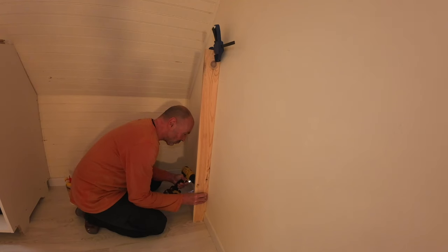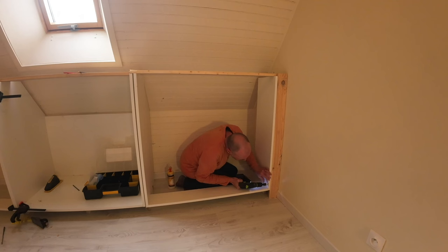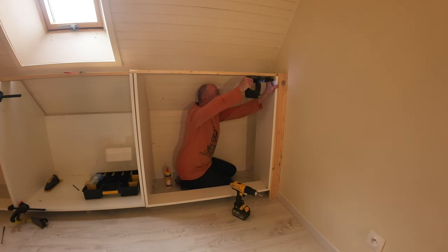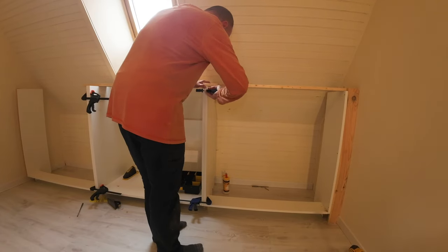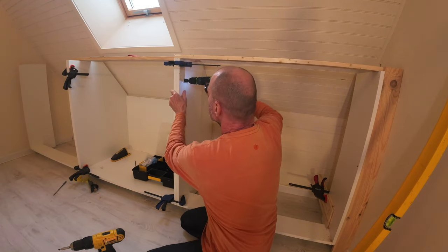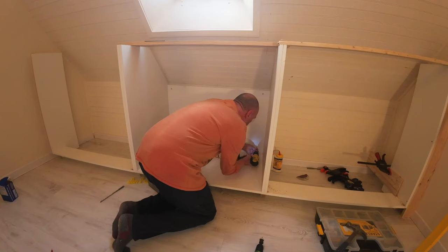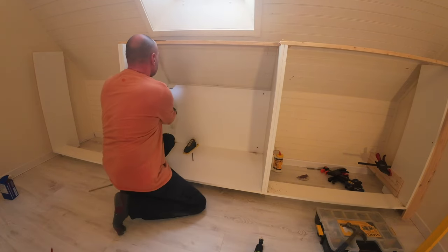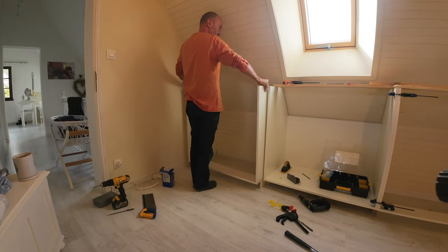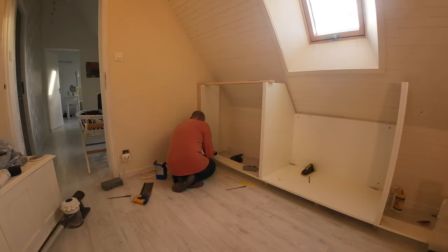Back in the bedroom I needed to fettle the scribe to the wall to ensure the best fit. I could then glue and screw that piece to the ground I had fixed to the wall. Next I insert the right hand wing and fix it to the piece I've just fixed to the wall. Pieces of timber at the top are just temporary braces. With the right hand frame fitted I can now screw this frame to the middle section and screw the middle section back to the wall. Finally the left hand section is secured to the middle section and to the ground and the scribe on the left hand side.